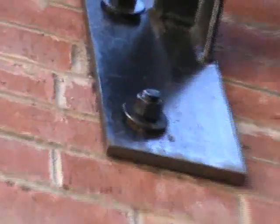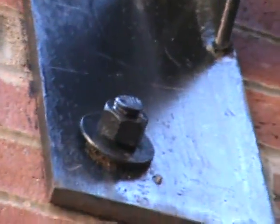the cantilever. Any questions? Fire escape engineers, inspector summary video, and there's just another quick shot of the half inch expansion bolts, which is not industry standard or code compliant on a platform of this size. They should be at least 3/4, and here's where they put the 3/4. If they had put these 3/4 up there and those half inches down here, this thing would have been to code. So this is not to code right now as we see it.